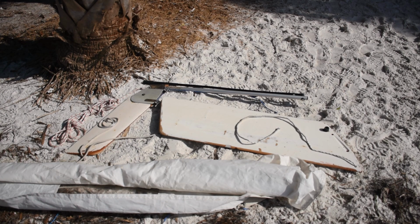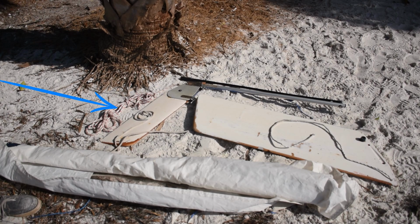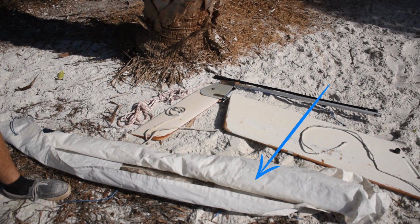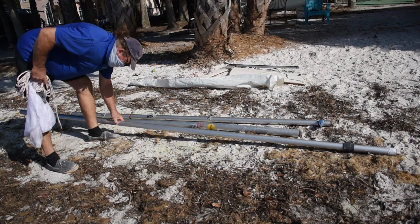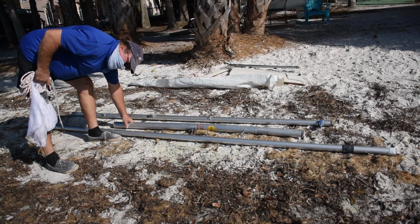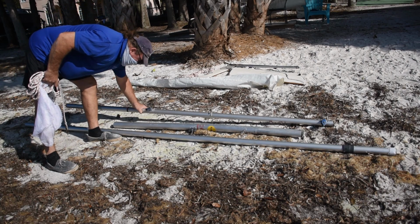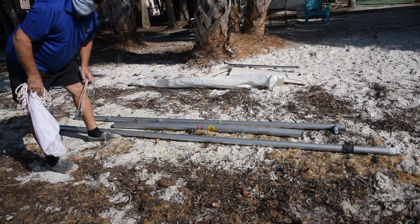Here we have the items that you will need to set up your Laser to go sailing with. We have the rudder tiller assembly, the sheet line, the dagger board, the sail, and then down here we have our rig assembly. We have the mast top, the 4.7 mast base. We will be rigging the 4.7 sail today for demonstration purposes. We also have radial and full rig sails for the Laser. And you have your boom and your vang assembly. And that is all you need to go.